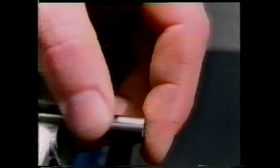Here's a piece of high carbon steel. We can test its hardness with a file. It's quite easy to file, so in its present state, it must be relatively soft. Now, at a temperature of about 900 degrees centigrade, we have another piece of the same material in this furnace. We'll cool it rapidly, or quench it, in cold water. Now let's see if it's any harder than the untreated piece. It's much harder. In fact, it's so hard the file hasn't cut it at all.